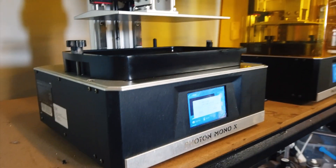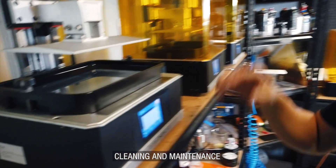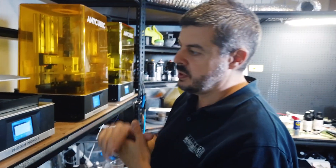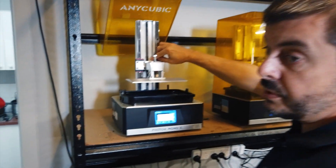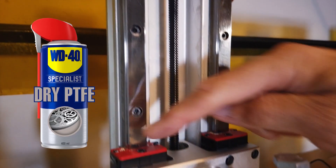The Wi-Fi works the same way — it still doesn't work in the office here; I don't think it's compatible with the security settings on our particular Wi-Fi router. As far as cleaning these machines is concerned, if you start to see layers on your print which are visible — bloated-out layers visible on the print — your best measure for that is to clean as much as you can of the bearings on here, as well as re-lubricating the lead screw. You can do that with any kind of grease you may have, or get some industrial spray — lithium-based ones are quite good — or WD-40 for cleaning.